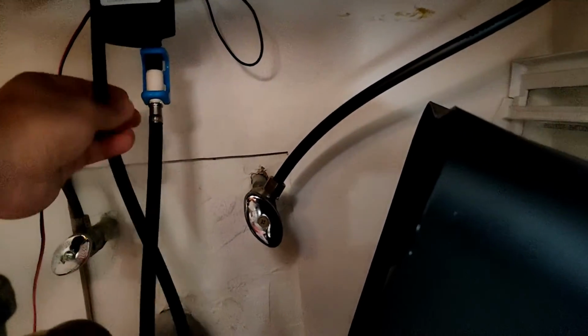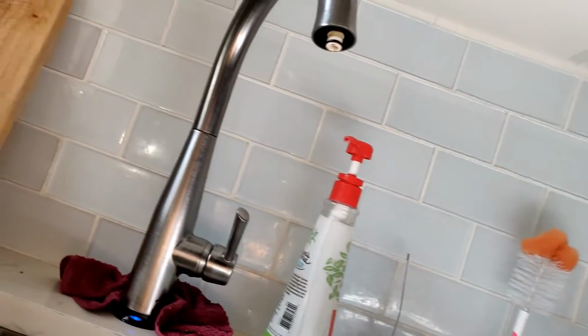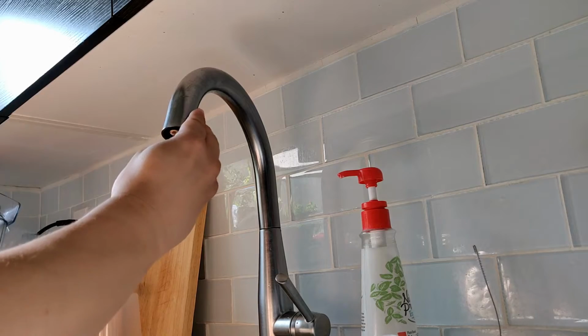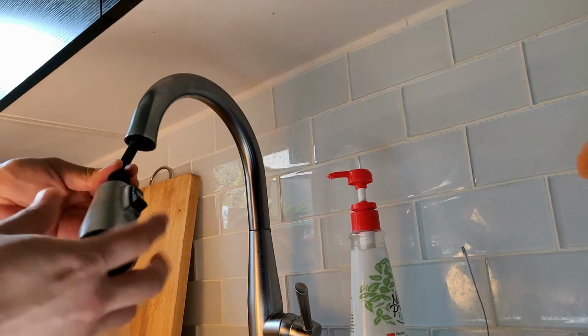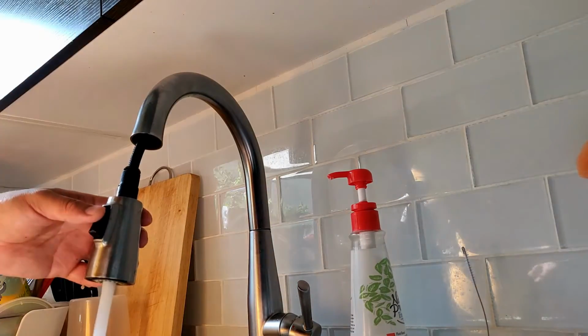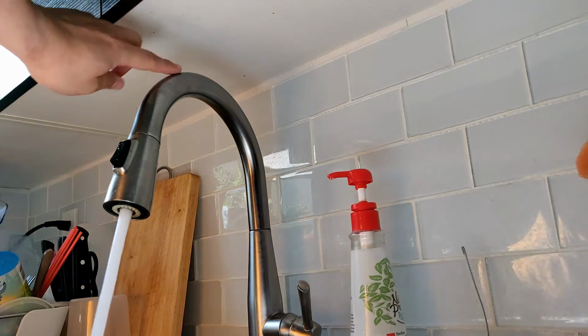Okay, now we have to bring the hose back out. Hopefully it didn't retract itself too far back in the sink. Open up the cabinet below and push the hose back out. You may need another person catching it from the top, but I was able to handle both sides by myself. Then reinstall the handle to the hose, test the water flow, and dock it back to the faucet. Now you have finished replacing the magnet on your Delta Touch2O faucet.